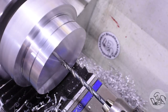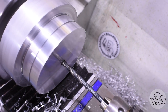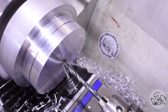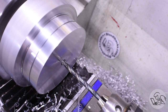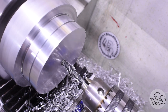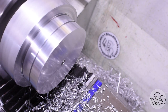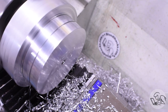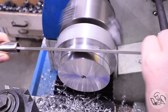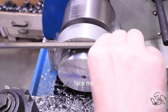While I have it set up on the lathe I'm going to drill a hole all the way through. There's already a partial hole from a previous fixture made with this chunk. Even though the lower disc doesn't actually need a hole, I'm going to end up with one that I'll plug later — but there's really no choice because I need the hole to set this up on the bandsaw. A nice side effect of those starting grooves with the parting blade is I can come in and deburr both edges of both discs, so after the bandsaw goes through there will already be nice chamfered edges all the way around.